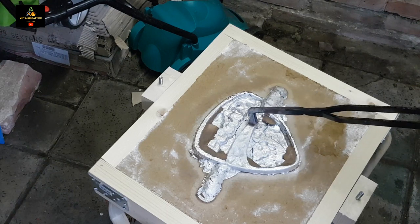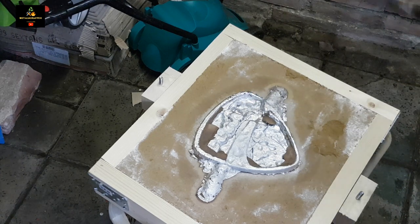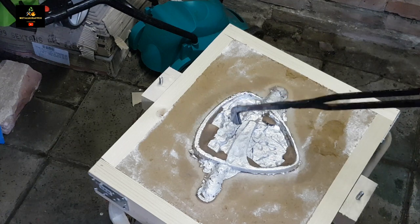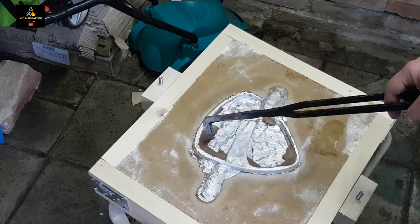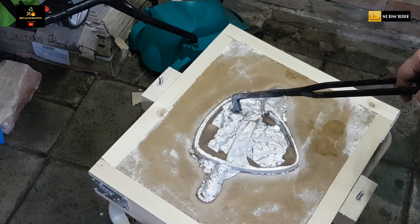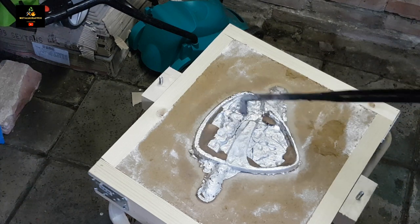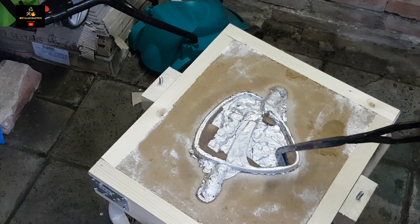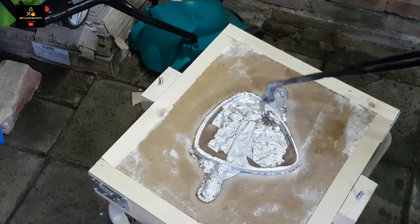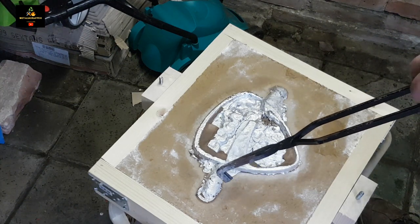Even so with this, and we can see this here has not filled up, so it was to test if, even though the letters were missing, and I think most of the letters that were missing were not that bad, because I still see a D, a U, a C, an A, but I think it's still too much work to clean up and didn't fill this piece. So there's something wrong with my metal flow.